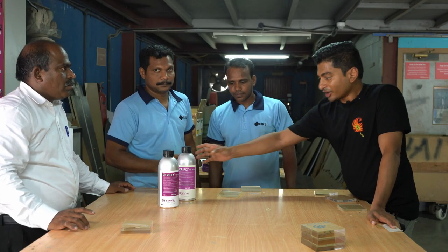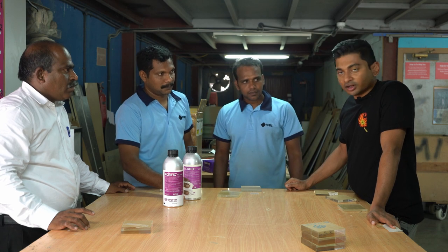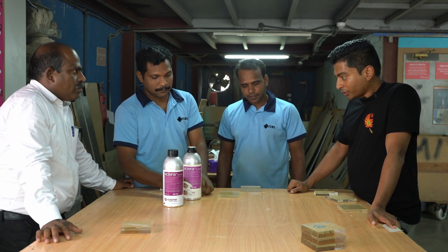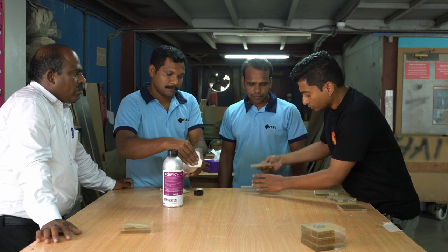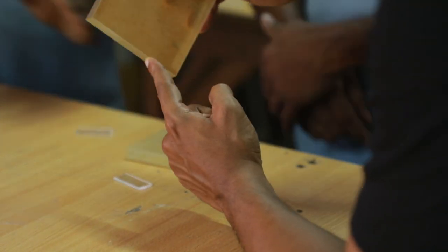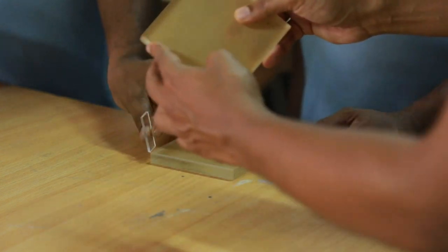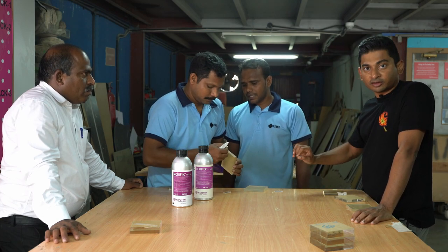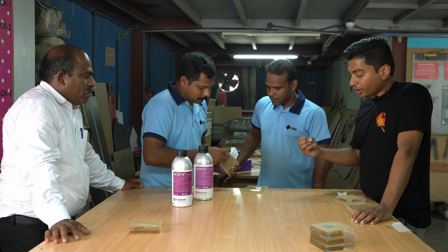So Godfrey and Joseph are going to help us now to show Acryfix 192, which I would say is the next in terms of difficulty after 127. This is a more viscous glue, and along with that we have the thinner again, which is used to prepare the surface. They are going to do a straight joint, and one of the pieces of acrylic is slightly beveled by almost 2 mm — so it's not exactly straight — and that bevel space allows the glue to flow in and form the bond. Being a very viscous glue, it needs space to enter and start polymerizing to create the bond.